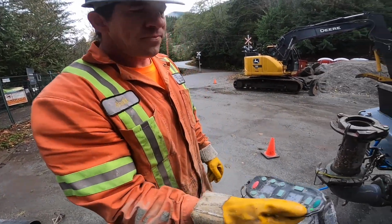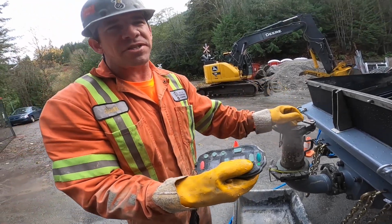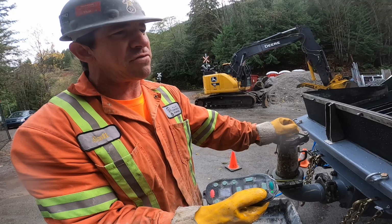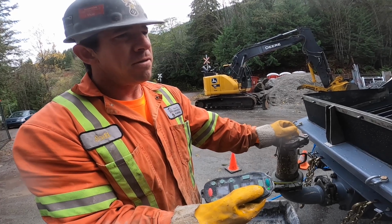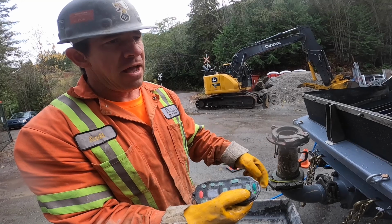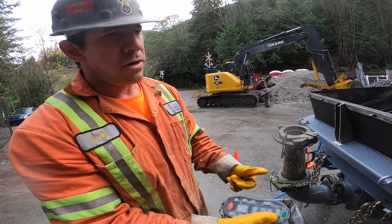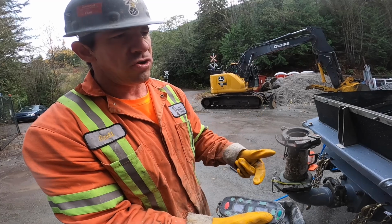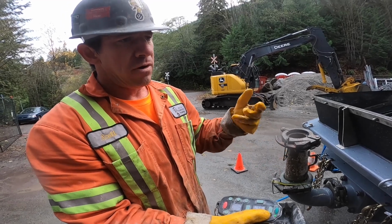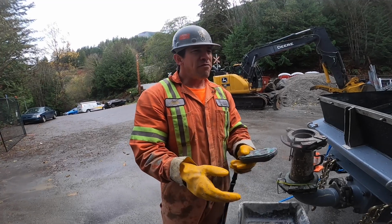And I should mention, the priming speed here, I like a stroke every 5 to 7 seconds. So let's wait for it to shift over. 1, 2, 3, 4, 5, 6. That's a little bit quick. 1, 2, 3, 4, 5, 6, 7. Bang on. Every 5 to 7 seconds.